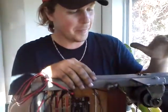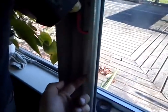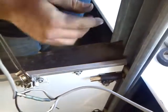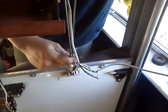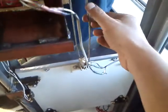I'm Nate — I built this automatic chicken door. We made it out of garage door track. It's got ball bearings with seals so you can seal out any rats or vermin that want to come into the chicken coop. There's aircraft cable for the pulley — not strictly necessary, but I figured I'd design that in now instead of having to redesign it later.